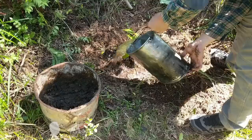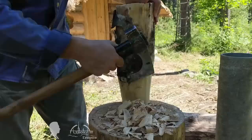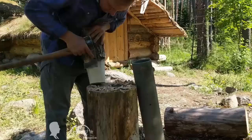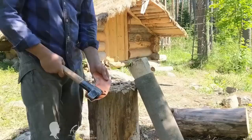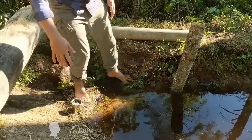With all urgent tasks done, it was time for some fun. I decided to make an overflow valve in my dam. The valve will help me to quickly raise the water level in my pond as needed, and when I leave camp I can leave it open, preventing the dam from working as a sludge filter and just letting water flow downstream. I avoided using green wood on purpose because it will swell and can even crack the pipe, so I made the plug from a semi-rotted aspen branch. My new bimetal bearded axe helped achieve a perfect fit — if you want to see how it was forged from a tie plate and an old metal file, I will leave a link below.